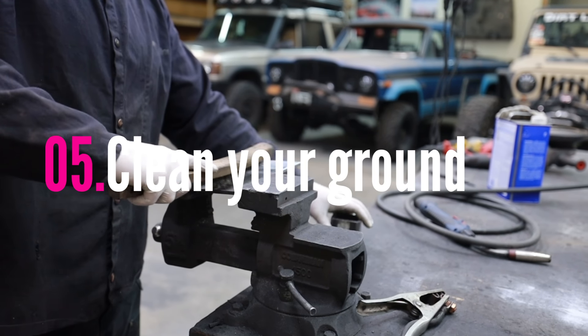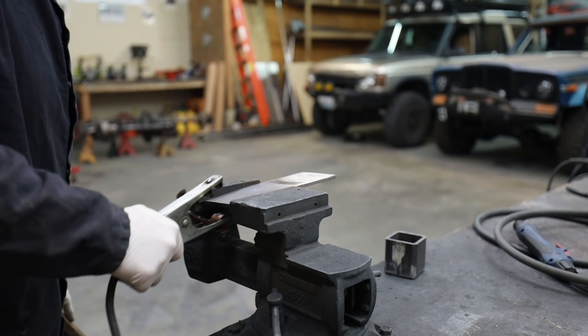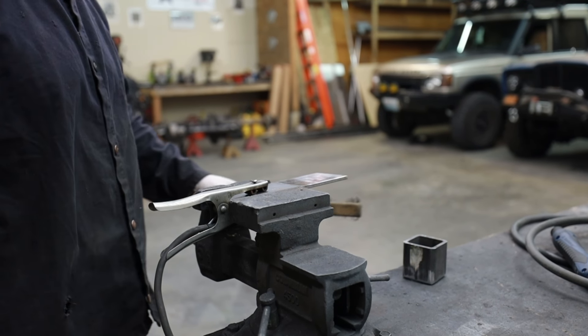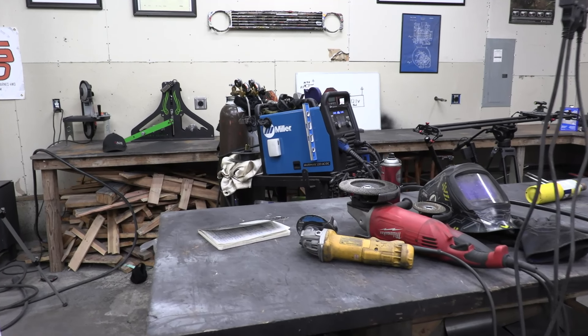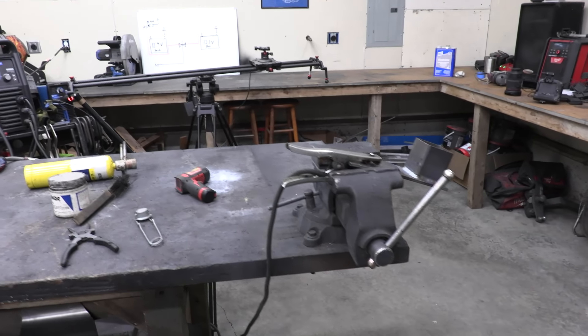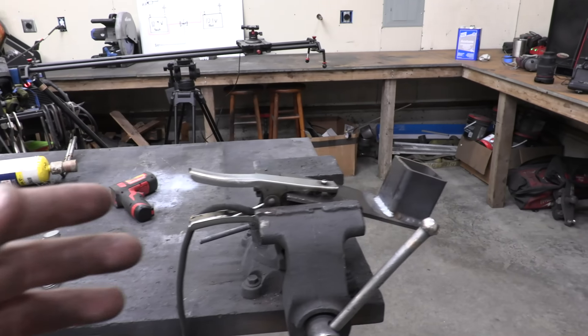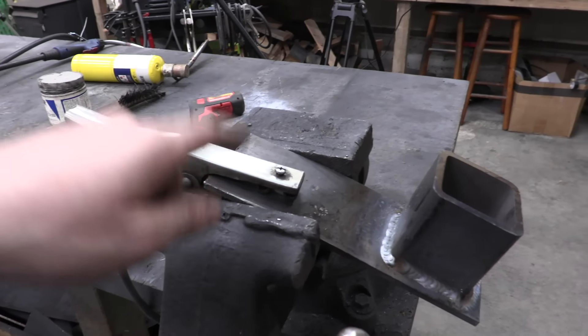The fifth recommendation is to clean your ground and locate it as close to your weld as possible. This is important to everybody that welds — whether it's a 220 or a 110 — but it's even more important with a 110. A dirty ground will reduce the amount of energy between the machine and your weld, and the longer the distance, the more energy is reduced. For example, if you grounded your machine to one corner of a steel table and were welding on the other corner, you'd lose quite a bit of energy over that distance. With a 220 you start with higher energy so you won't notice the loss as much, but with a 110 you want to take advantage of every bit of energy the machine can churn out.